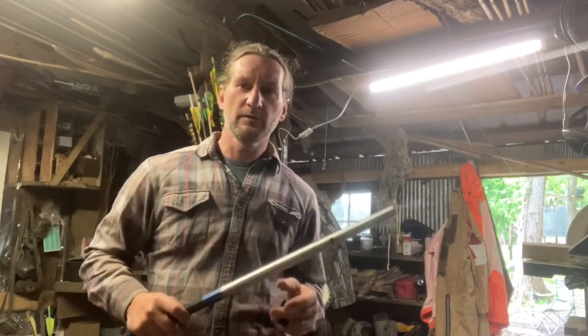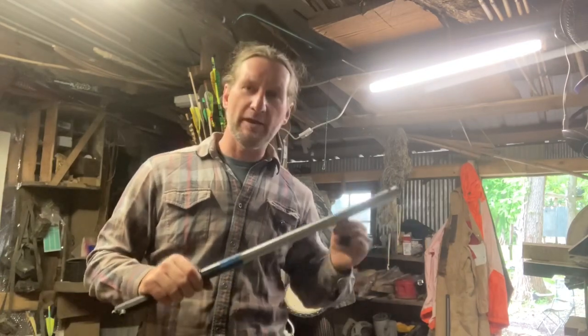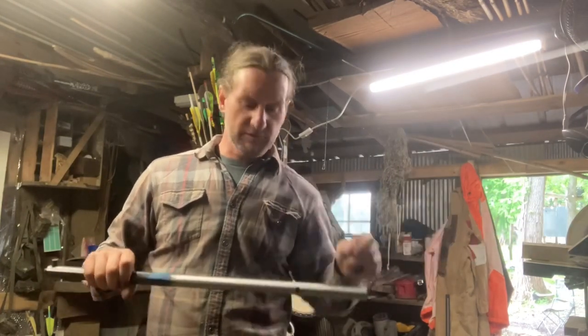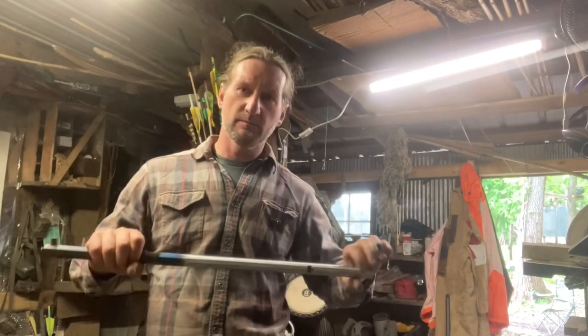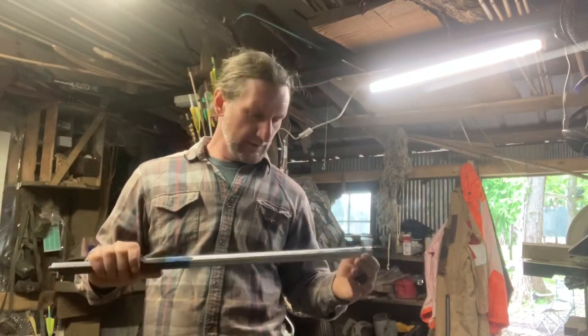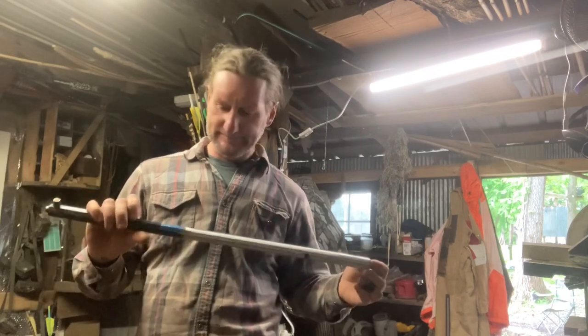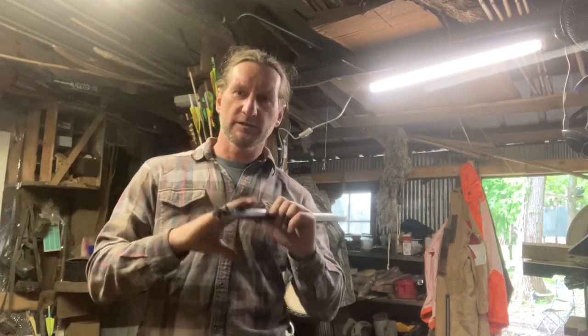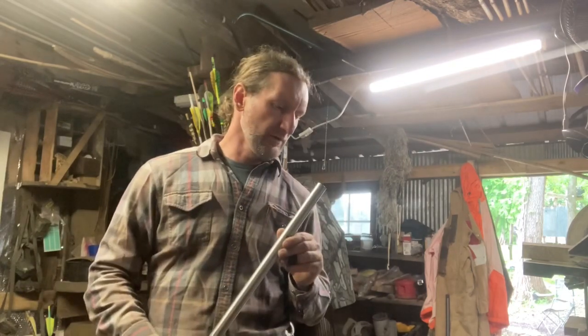All right, so now that we have done irreparable damage to our elbows by doing that much draw filing, we're going to put her up here on the old belt sander and just kind of even it up. Just let it spin a little bit on the sander. That'll clean up any rough edges. Then we'll hit it all down real good with some emery cloth and get the rest of this bluing off, because we're not going to have a blued barrel.